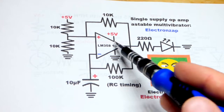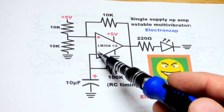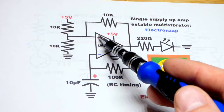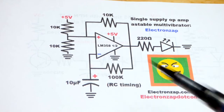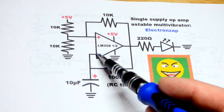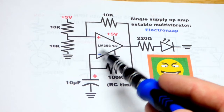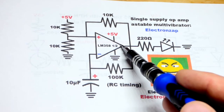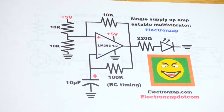Since this is an op-amp, we have the non-inverting input on top in the schematic. On the actual component, the positions are reversed — the inverting input is above the non-inverting input — so pay close attention when building it. With negative feedback, the op-amp tries to keep the voltages at both inputs equal, so the output goes high or low to bring the inverting input to match the set voltage.